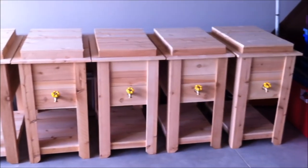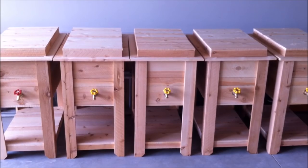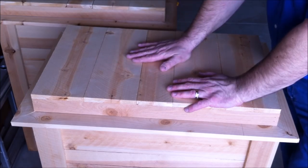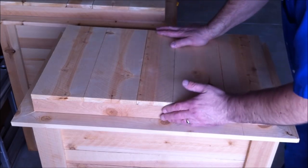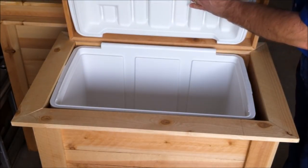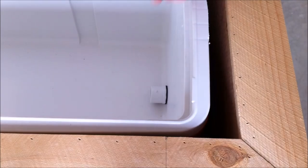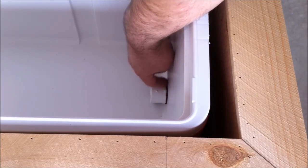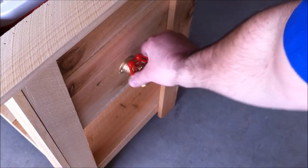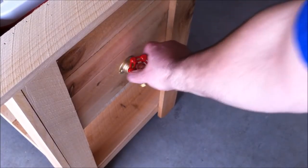I'm out in my main garage and over the weekend I put a little more effort into my cooler boxes. I'm not doing a video on these — perhaps the next time I make them I will. I've built five of them and they are ready for stain and hardware. These boxes are made entirely of cedar fence pickets, which are about two dollars to two-fifty a piece depending on where you get them. The top is finished but not hinged yet — when it is hinged it will lift up and bring the top of the cooler with it; the cooler top will actually be mounted inside of this lid. Down inside the cooler I used a little PVC fitting and a piece of rubber to make a kind of o-ring so it wouldn't leak, and on the outside I put a spigot so you can just turn it and drain all the liquid from the melted ice right out of your cooler.